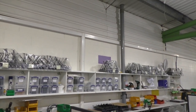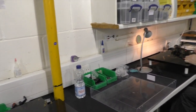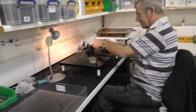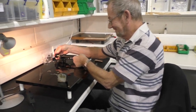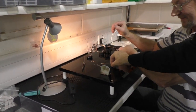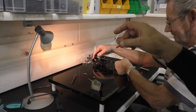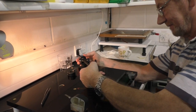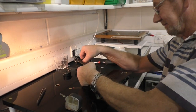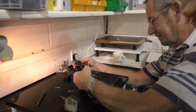Get yourself a 20 milligram weight — every arm that comes your way. I will do that. Let's hold them accountable. To do the horizontal bearing friction, all you do is put it on the head shell. Vertical's easy — you just balance the arm and drop the weight on. It doesn't need to move huge amounts, as long as it just moves.